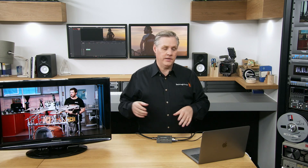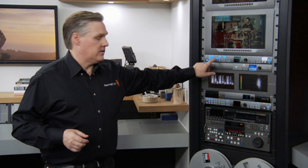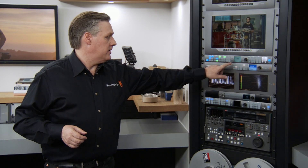I've got a HD television with a HD source currently connected from the Teranex. This light is illuminated saying it's 1080. If I change that to Ultra HD, the Teranex will change over to Ultra HD. What's happened is the converter has now seen that the SDI input is Ultra HD, it knows the TV cannot do Ultra HD, so it's used the down converter to take care of it. You can see there's still an image there — the converter is handling that mismatch and displaying Ultra HD on a HD TV.